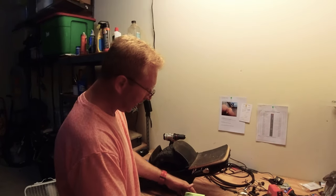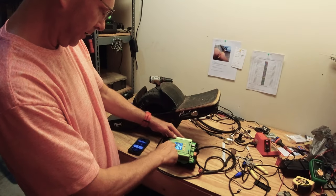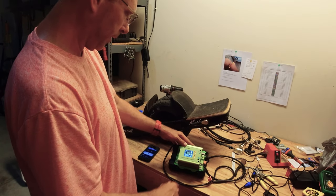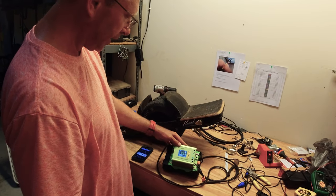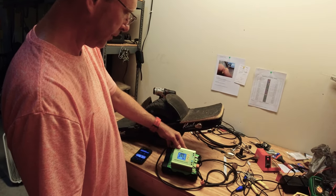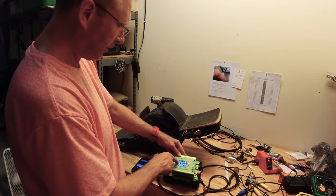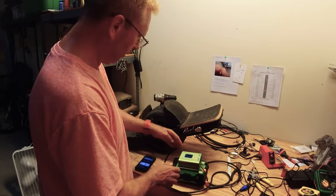And if we look at the battery, we see that we're delivering exactly 63 volts, and we're at 2.25 amps, 140 watts. And you can see our battery voltage is already starting to visibly drop from, I think we started around 56 or 57 volts. And if that's interesting, we're actually starting to get a charge indicator on this battery, on the solar charger controller.